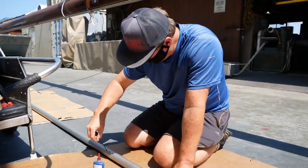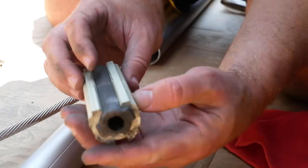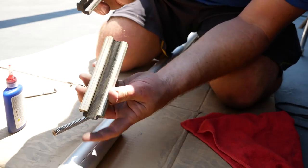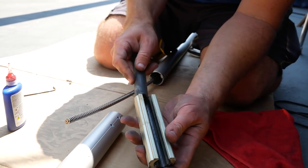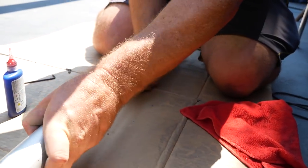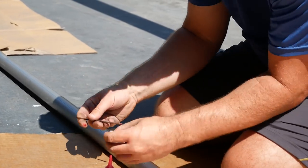Putting the new headstay in through the furler. Chris showed me the place for pulling apart each of these junctions — there's just a little connector piece, and then there's a little bushing in here. If that looks clean and not worn, we're just going to go ahead and put it back in. Turn it to lock it in, place the wire in it, and put it back in with red Loctite so it won't back out by itself.